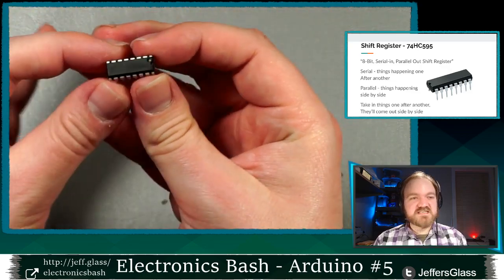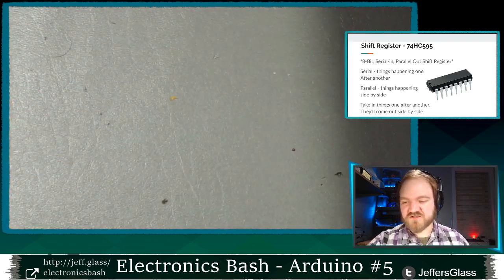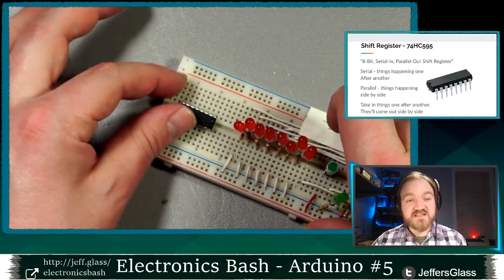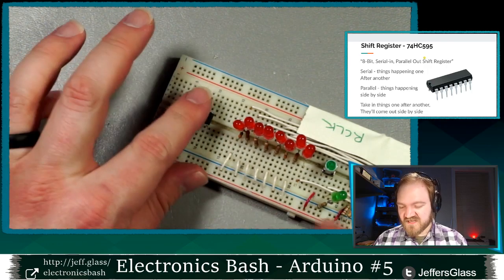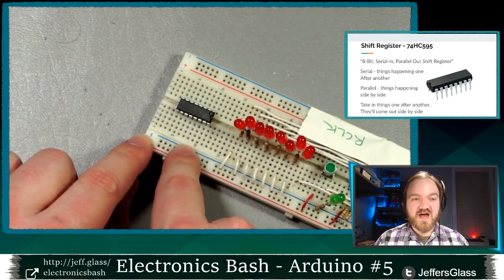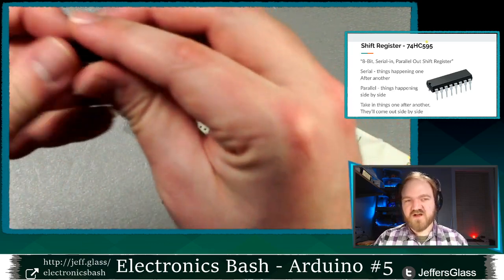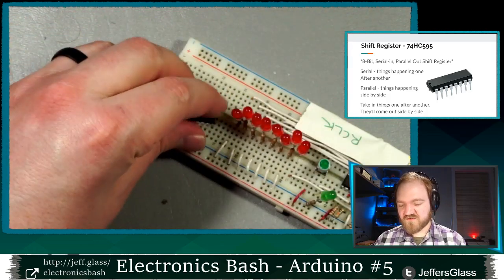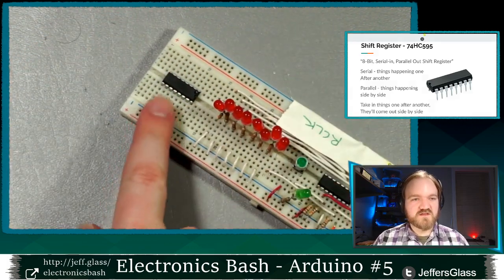They come in all sorts of sizes. This is a pretty typical width. This is 3/10 of an inch, which is a size such that it will easily go into the pins on a breadboard. And chips like this are actually the reason, getting a little ahead of ourselves, that breadboards have this notch down the center. It's so you can plug in one set of pins on one side, so they'll connect to this row of connections, and the other set of pins on the other side, so they'll connect to this row of connections. Often when you pull them right out of the pack, you have to squeeze the pins in a little bit so they're a little more vertical, and then they will punch right down into your breadboard there, right?